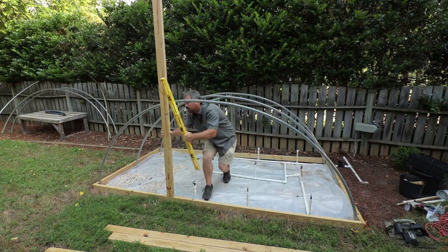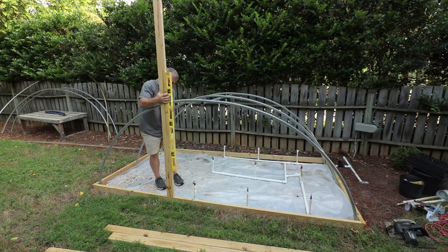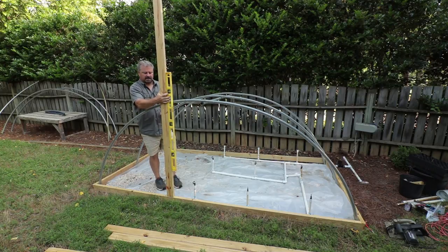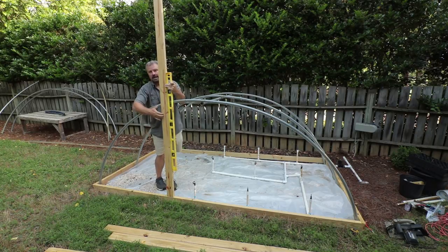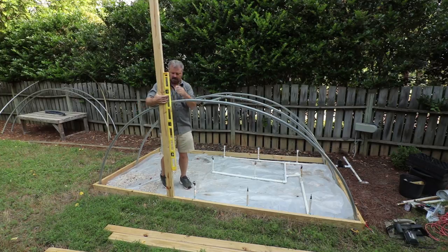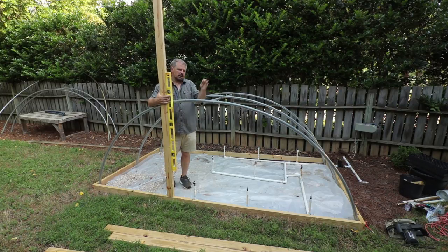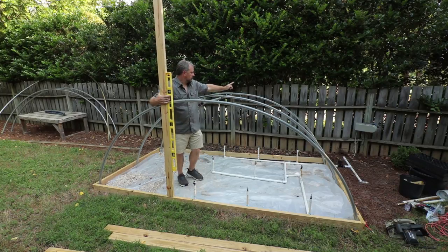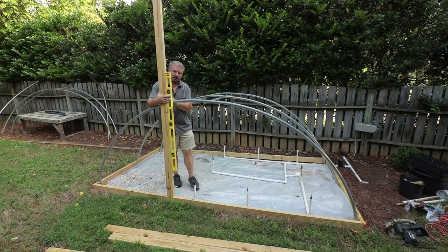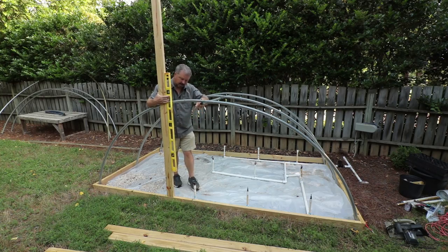One upright will go here and I'll use a level on the side of it to make sure it's plumb, and then I'll mark the back of it at the height of the house for my cut line. I hand-bent these rails so each one is going to be a different height — it's easier to just hold them up, put a level on them, mark the top, make a cut, and you're good to go. I'll do that four times — one here, one here, one there, and one there — with a three-foot gap in the middle. I'll drill a hole through the wood and the metal and put a bolt through at the top, and toe-screw it into the bottom frame at an angle.